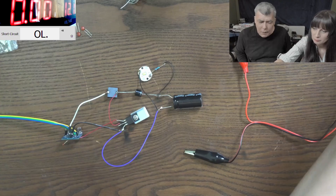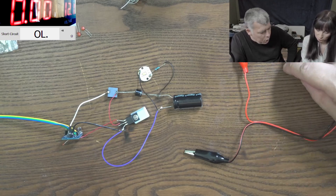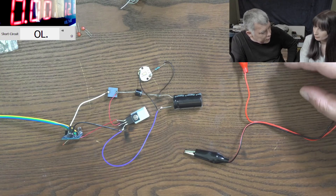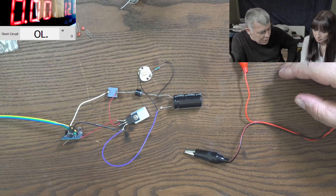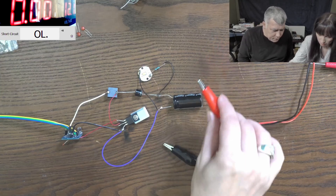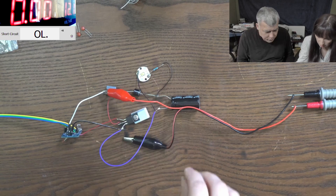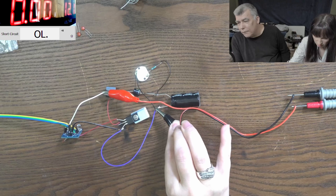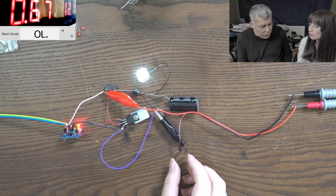Something about limits we didn't discuss: you can't really push too much current through the coil — at some point the core will get saturated. So be careful when raising the duty cycle, because raising the duty cycle will increase the current through the coil. That MOSFET is actually shorting that coil to ground, so be very careful with adjustments. You have plus and minus — connect them and let's see.